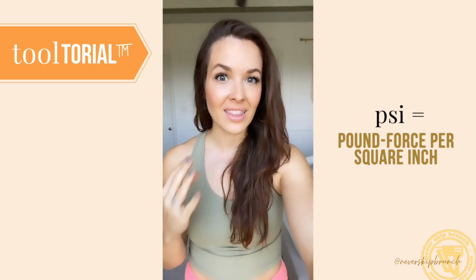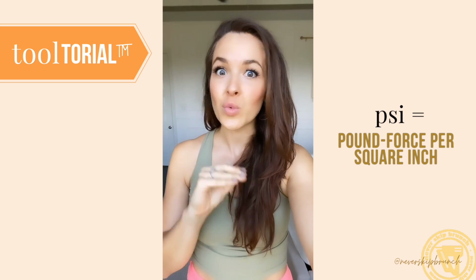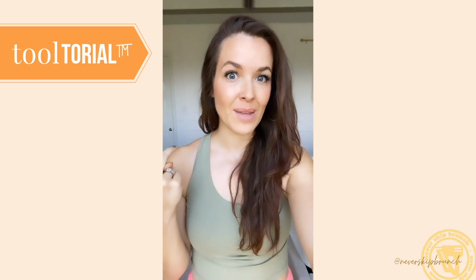The numbers on the gauges are PSI. This is just the level of pressure. Everything is rated for a certain pressure level. For example, my hose is rated for 200. If it gets above that, it could burst. My tool is rated for 120, but I can use it around 90, and that's given me the best results so far. So know your pressure limits for the accessories you're using and adjust your gauge as needed.